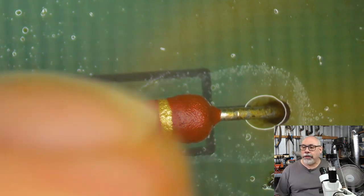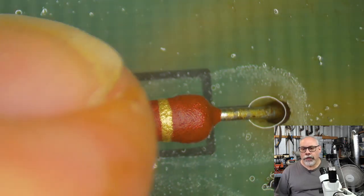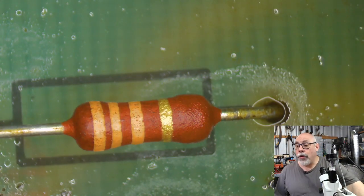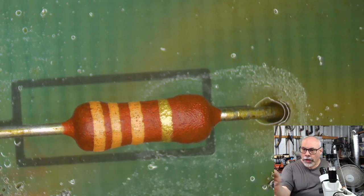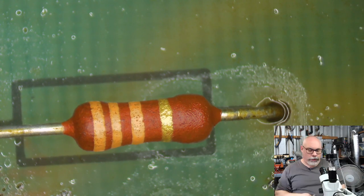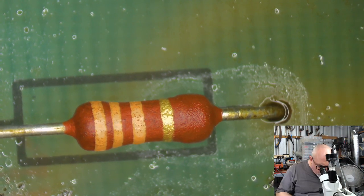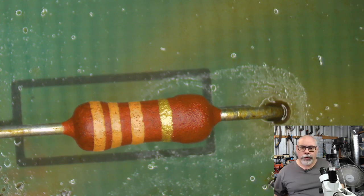This resistor has the tendency to get incredibly hot. And obviously with a device that has no fan, that can potentially be a problem. So what I often do when I work with these is I go and replace that with a nice big 1 watt resistor, which you're probably not going to be able to see there. So I will do that for this one as well. Let's call it a bit of future proofing to try and protect it.